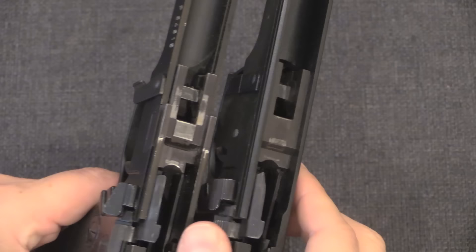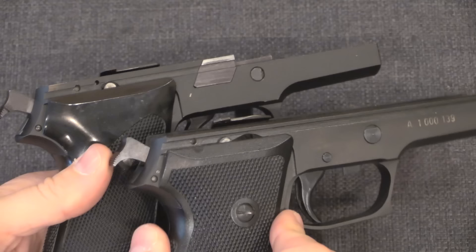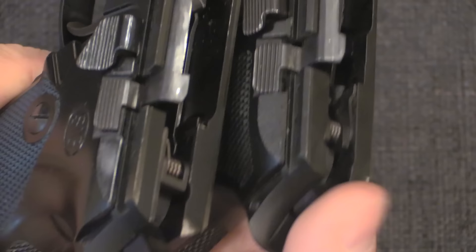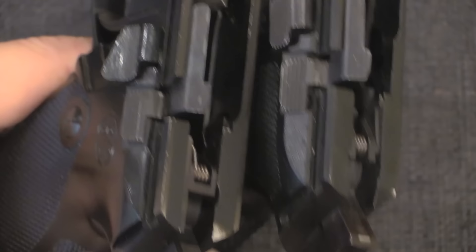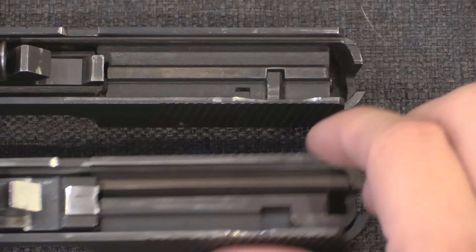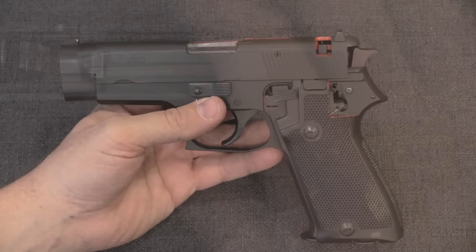One of the other substantial changes: there were some minor changes to the profile of the locking block. With the military guns it was now pinned into the frame instead of having a large dovetail style cutout. And lastly, a firing pin safety has been added. There's a little lever on the side of the fire control group, and when you pull the trigger, that lever lifts up. There is no such lever on the prototype. What that lever does is push this spring-loaded blocking piece up, which allows the firing pin to actually move. On the prototype slide, there is no such piece — there is a cutout there, but no firing pin safety built into it.